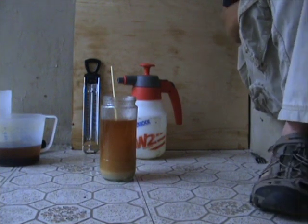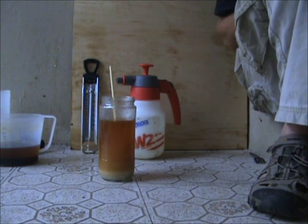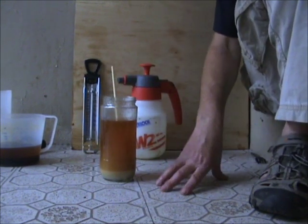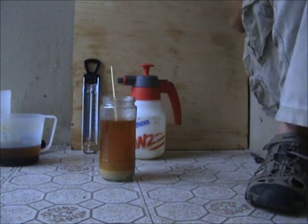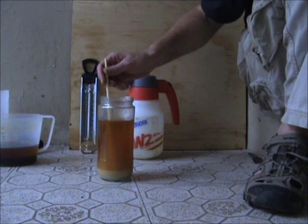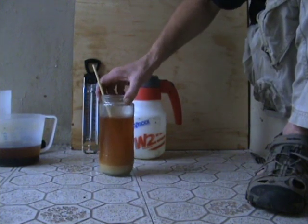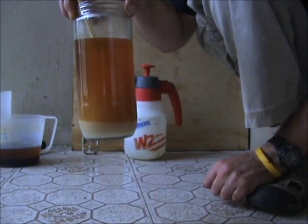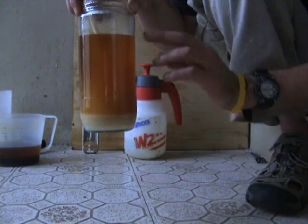It's best to do it in a warmer place, as warmth obviously helps the separation. In winter time it can be a bit of a problem for drying biodiesel unless you've got a warm place to allow that process to happen. Generally I stop making biodiesel during winter time, but I stock up with oil during the warmer seasons. During winter I'll go with a 50/50 mix of biodiesel to road diesel. As you can see at the bottom, that thick cloudy water layer — that's all the methoxide and traces of sediment that we don't want in the biodiesel.